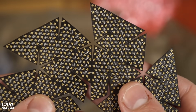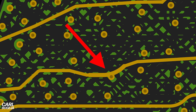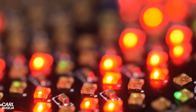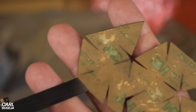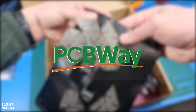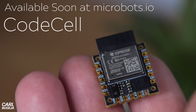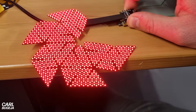Unfortunately the first PCB I received had issues — there was a short I didn't catch in my panel design, and it was inside one of the inner layers so I couldn't fix or test the board. The assembly also couldn't be tested and some LEDs had soldering issues. The adhesive on the back was wet from alcohol cleaning, making it unmountable, but together with PCBWay's help we resolved these issues and they sponsored five fresh new boards. With the new boards, all 945 LEDs were blinking red, green, and blue.